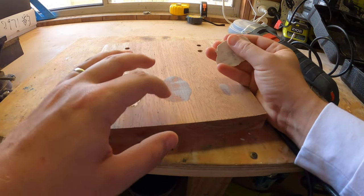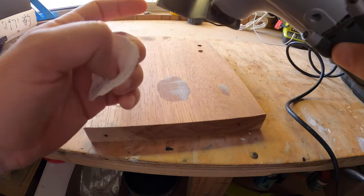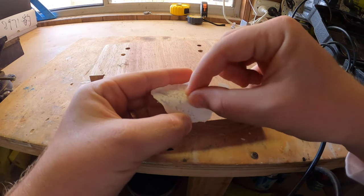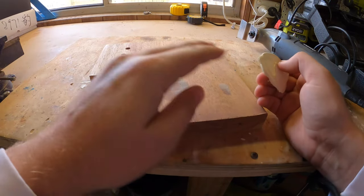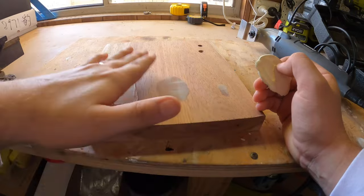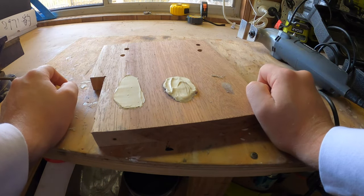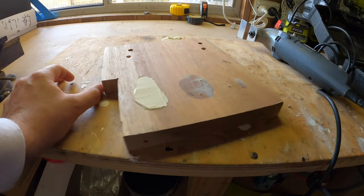Same thing again - I'm obviously not digging into the wood. Because it's a blunt surface, as long as you don't dig it into the wood and you run parallel, it will typically just bring it straight off. You can see pieces there that have come off almost like an eraser on paper. But that surface is as smooth - it just feels like a smooth surface, which is kind of amazing given how easy that is. If you were removing this without this tool using a blade, that could take you half an hour and you'd probably have divots into the wood where you cut in. Right tool for the job makes such a big difference.